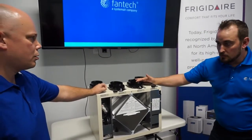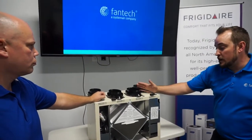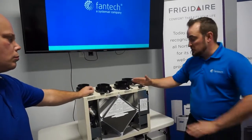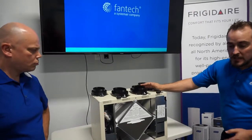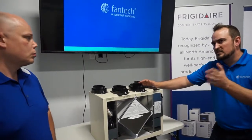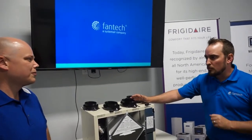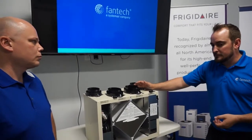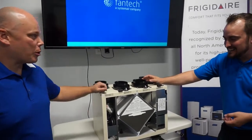Gotcha. So, our product range in our HRVs and ERVs, First Air appliances, you're looking at anything from a small 70 CFM unit, which is, I'd say, 11 inches in depth, to a 2800 CFM commercial unit. Wow. So in the residential, we stop at around 400 CFM. We have a small commercial unit that can be used for residential, so it's 450 CFM. I've rarely seen that being installed in a home. That would take quite the monster home to put that guy in, right?